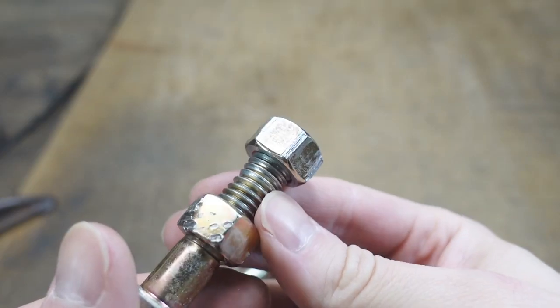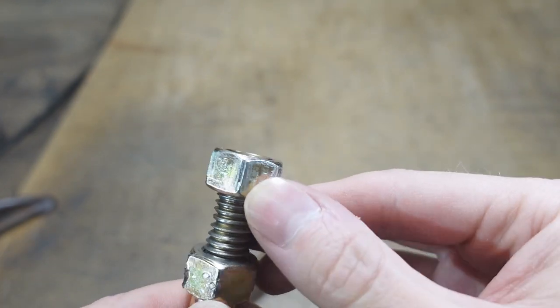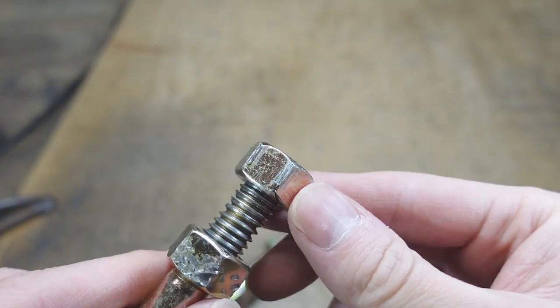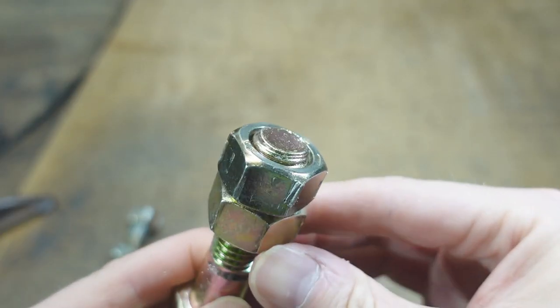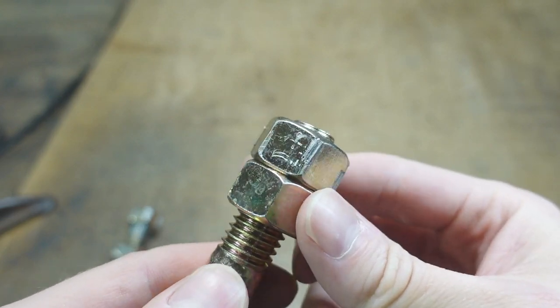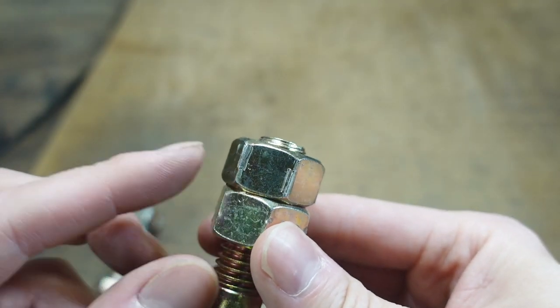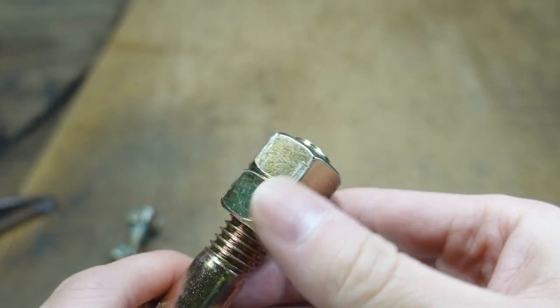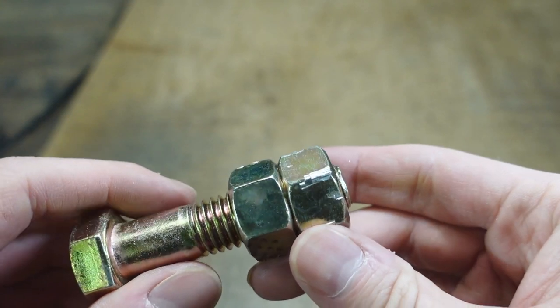Nope. Now you can see the aftermath. These are the 3/8" bolts I started with. I brought them up to 140 foot-pounds and it was able to break them loose, but it was tearing away the edges. So I moved up to these half inch bolts just to make sure the test was valid, and started back at 140 foot-pounds — it was able to break these loose. And then at 150, I just reached the limit — they were just flexing too much.